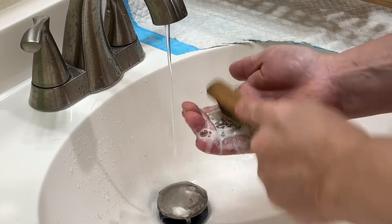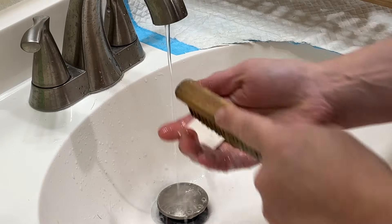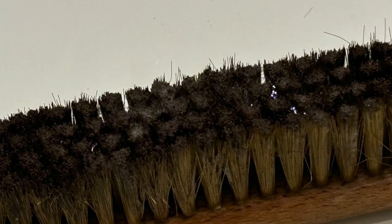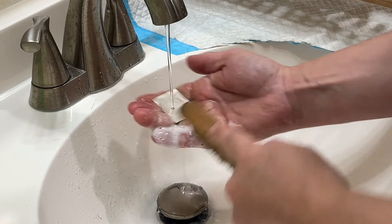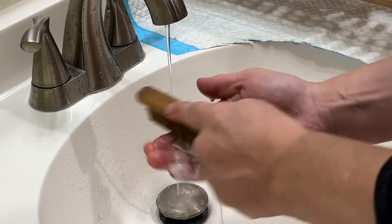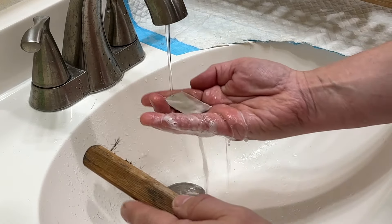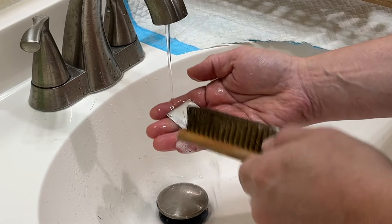After pickling and cleaning and neutralizing it, use a soft bristle brass brush with just basic dish soap to scrub the surface. It kind of burnishes that developing fine silver skin on the metal without removing anything. So it's very important that it's not abrasive at all — just a nice smooth cleaning process.